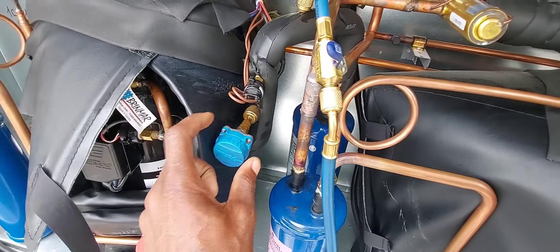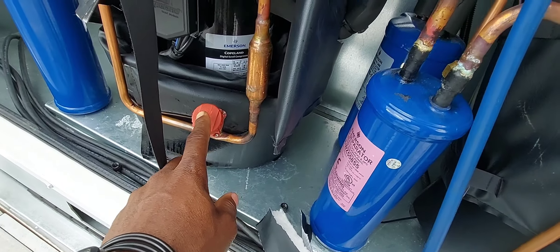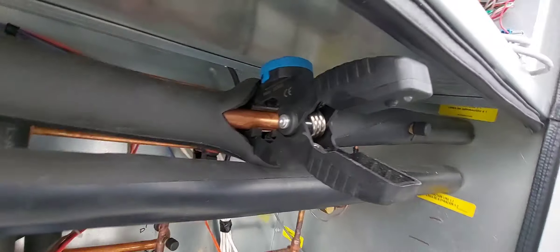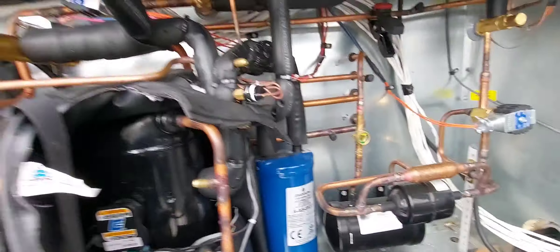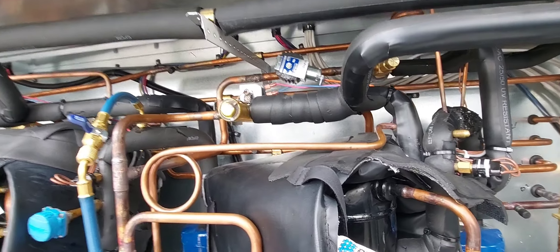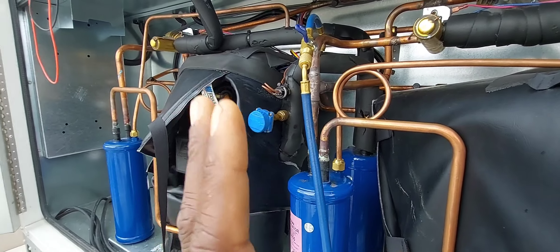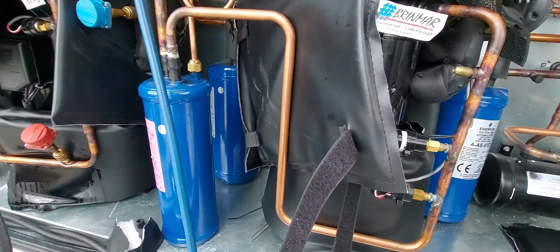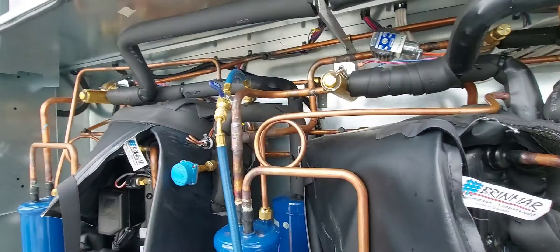This is somewhat different. This is pro-level stuff — not particularly for beginners or do-it-yourselfers. When you're doing a startup, you're going to want to fill out your startup sheet, as you can see here. It will help if you have the tools — makes it easier. Sub-cooling, superheat, pressures, temperatures — all that jazz. And I'm charging refrigerant as well; this is a split system.